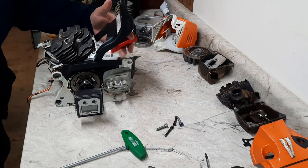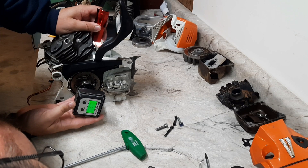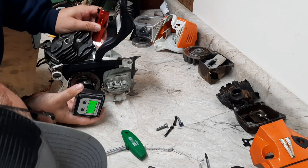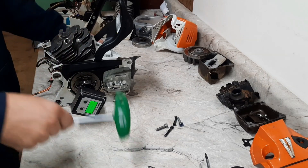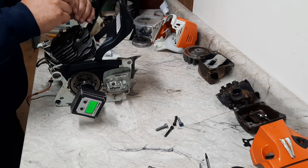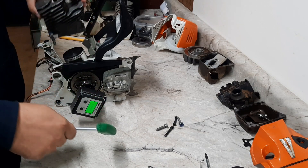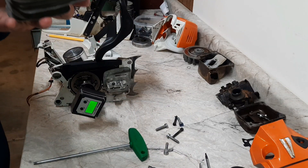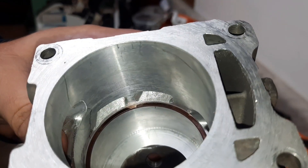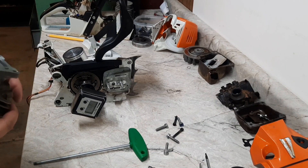With the wheel zeroed, come down to the bottom and slide your ring in. We'll do the transfers first. If you go a little bit past, you'd have to take it off, push the ring down, and double-check. But to show the concept: line up to your ring and mark your line. Hit your line — as long as you don't pull your wheel off you can always come back and check your progress. Do that with the transfers, do that with the exhaust, and you're good to go.